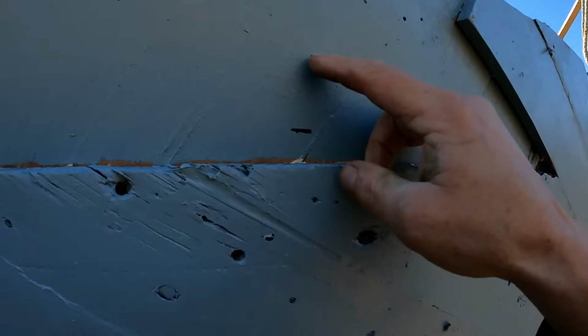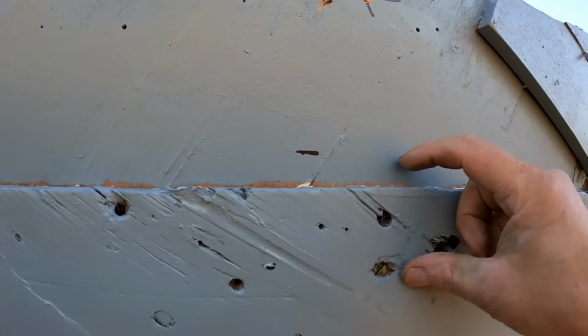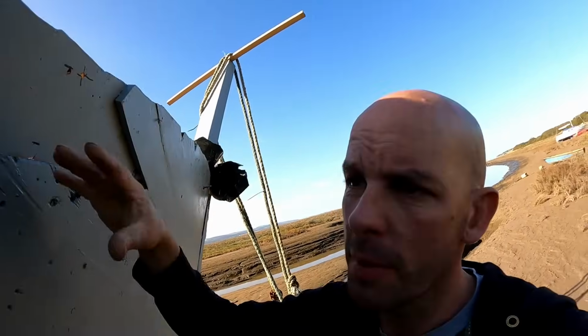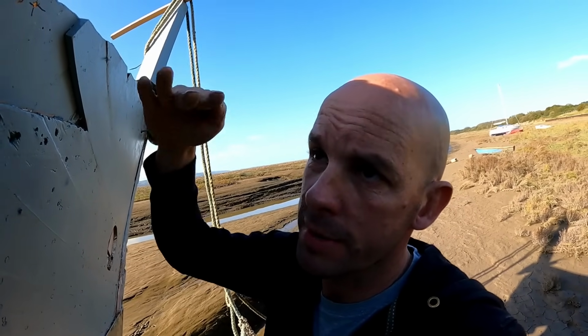because I've now measured down our saw cut depth was 111 millimetres. So there's our line there. So what we need to do now is put a batten on along here, following all the way down there, and then we can hopefully run our saw down it. Then we're going to put the saw through, then work out the angle, even though the angle changes throughout the boat. So we need to keep it steeper, and then we can plane back to the outside mark.